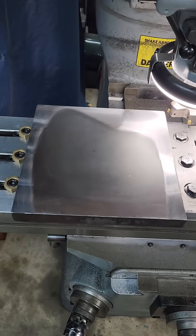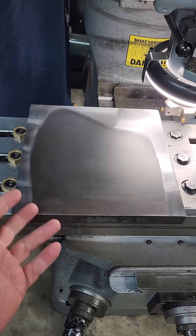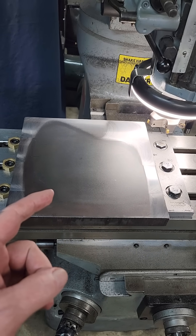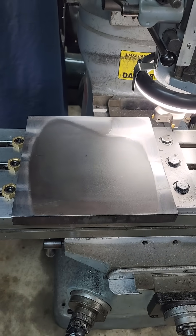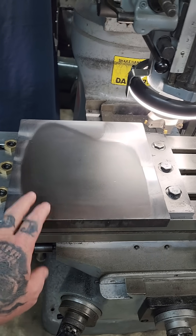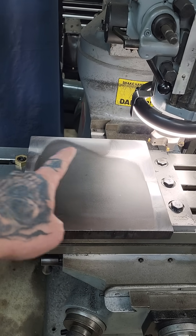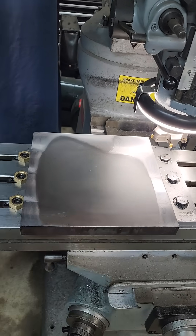Last night I faced the underside so that's flat. I flipped it over and the first pass at ten thousandths you can see the warpage of the plate — it appears that the plate is sunken in the middle on both sides. Before I did any machining on this plate I had put a straight edge on both sides to see which side I wanted to mount on the table first, and that was this side. If you look at the pattern here, this is why — because I wanted that on the table.